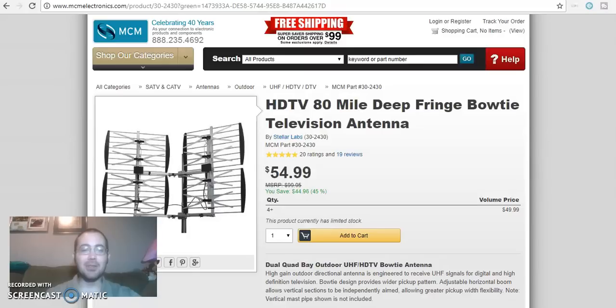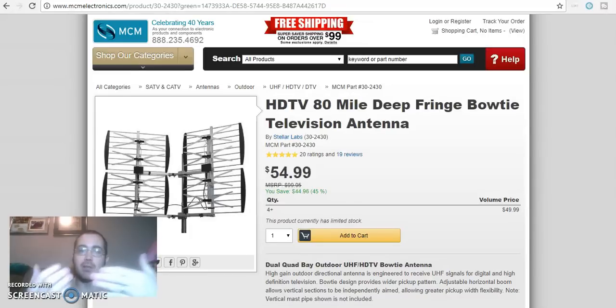Anyway, you get one of these. They're only $54.99. If you're in one direction, or like I said, in two separate directions, you can aim it like that. You cannot do a 360 with the thing. Like if you have one aiming in one direction and one aiming completely the other way around, because something with the polarities that the antenna picks up, it won't allow that. It'll actually cancel each other out. So if you're going to use this antenna, make sure it's all in one direction.